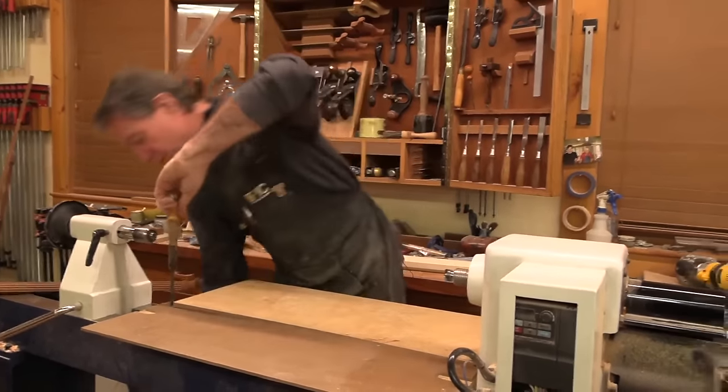Most lathes just have one singular indexing head, quite often with a bunch of pinholes, almost like a cribbage board in a circular manner, but with all the holes equally spaced. And usually it's divisible by three, or two, I guess. So you could do 12, you could do six, you could do all kinds of numbers there to break it up. But 12 is fairly common, you're just gonna get whatever you need into the space. So here, I'm gonna just start with this, and let's just try cutting a little groove down this end and see how it goes. We may have to reset it up.